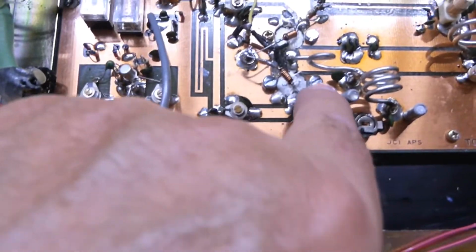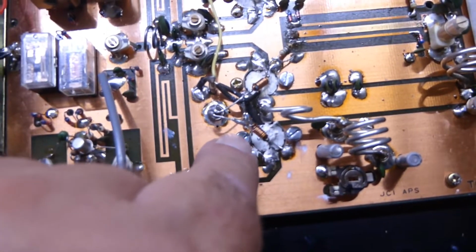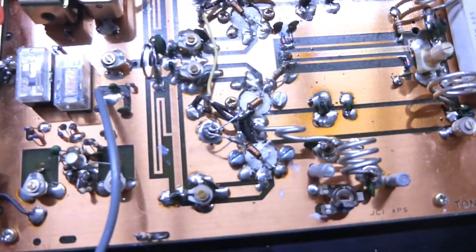So we've just got it all nearly back together. Just to go over it, we've still got the switches hanging out on the little LEDs off the front panel. We put a new socket on, which is nice and tight, 316 coax. The answer to the screw problem was to put an M3 bottom tap in the hole, and we got maybe a couple of turns on that, that's all. And then we've used longer screws with a compression washer underneath. Apologies that they're slot type. I don't really like them, prefer Phillips, but I haven't got any.